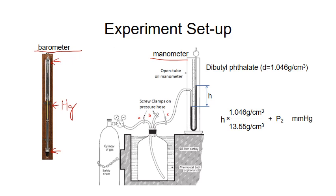The manometer contains a U-tube. One side of the U-tube is exposed to the atmosphere, and the other side connects to the system we want to measure. The height of the liquid inside the U-tube measures the difference between the system pressure and the atmosphere.